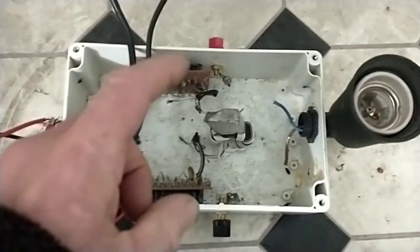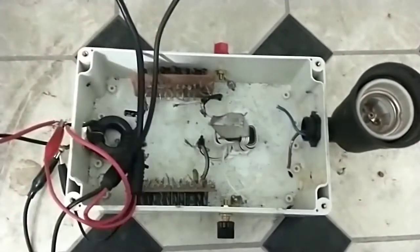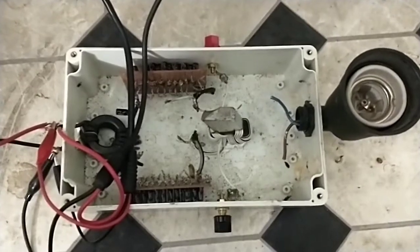For example, when I'm feeding an AC RF signal to both of these, the mean voltage on one goes more positive, and the mean voltage on the other goes more negative. But I can also tap it where there's still the waveform. So I have the two waveforms, which come from the one waveform, but one with a potential difference to the other in the sense of the mean voltage.